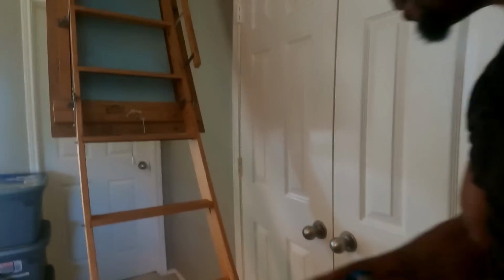Right here. I'm sorry. Honey, where's your zone? All right, explain to them what's going on. This the downstairs? Yeah, that's the downstairs. And like I say, the fan was running. I came up here, the fan was running. And that's the one you replaced the batteries in? Yeah, the one I put the batteries in and reset the thermostat. When I first came, it wasn't doing nothing. When I pressed it, it came on. And now it's on, and I checked the lines right here to see if it was cool. What'd it feel like? It was warm. So feel that liquid line right there.